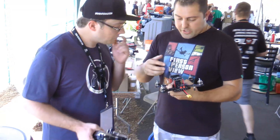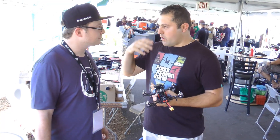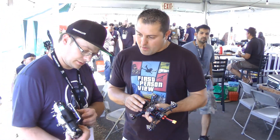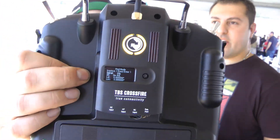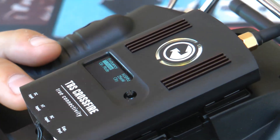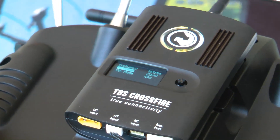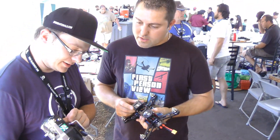Do you want me to pick up the remote to see the transmitter? Yeah, let's check it out. So you'll be able to see all the overlay on your OSD. If you're running DVR on your goggles or if you have a DVR on your downlink, you can see it there. You don't actually need the DVR — you can actually watch right here. So this is basically a UHF module that plugs into the back of your transmitter, your Taranis, and it's giving you the GPS coordinates right here in the back. Plus your uplink and your downlink.